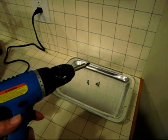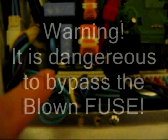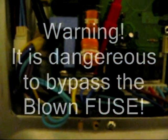Well, you just use my drill screwdriver and take off this plate off the back of the refrigerator. It's got 3 screws. And the back of the refrigerator area where the circuit board is in trouble is actually this particular fuse that has burned out. I bypassed it with a, see my little wire here, so it's not a good thing to keep doing.